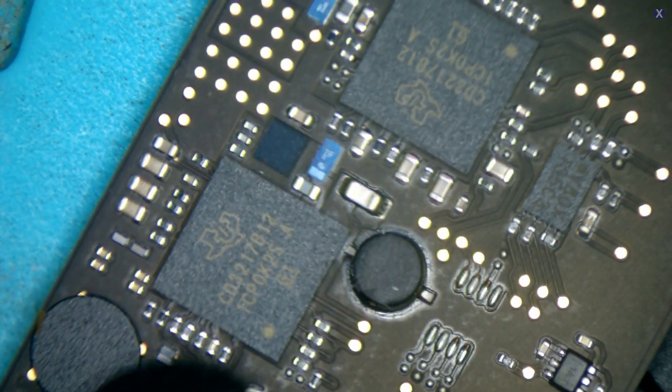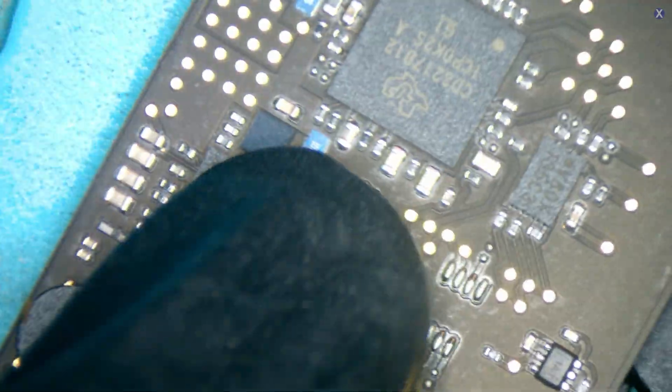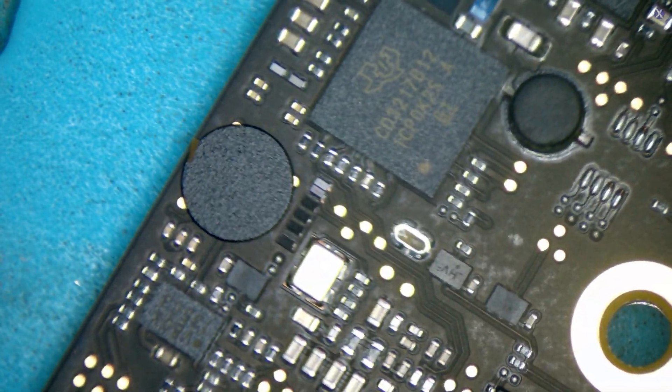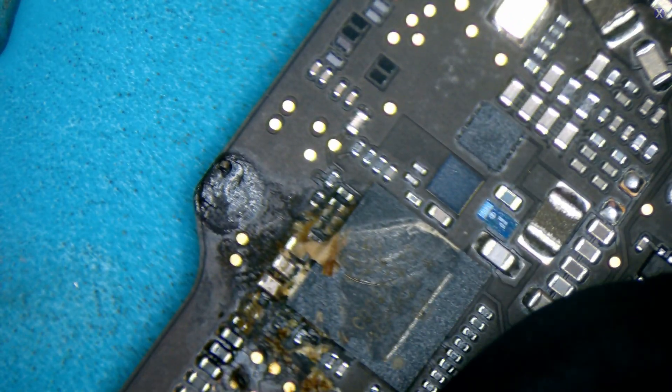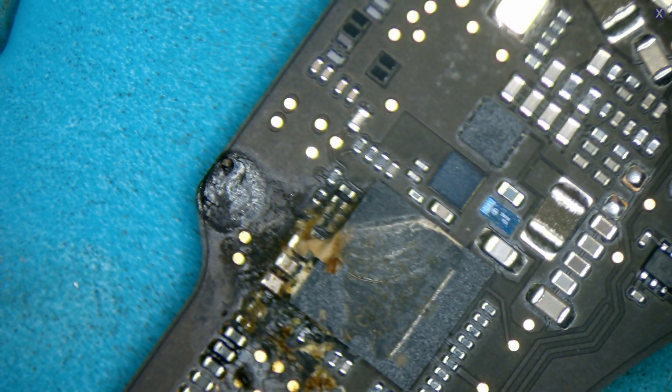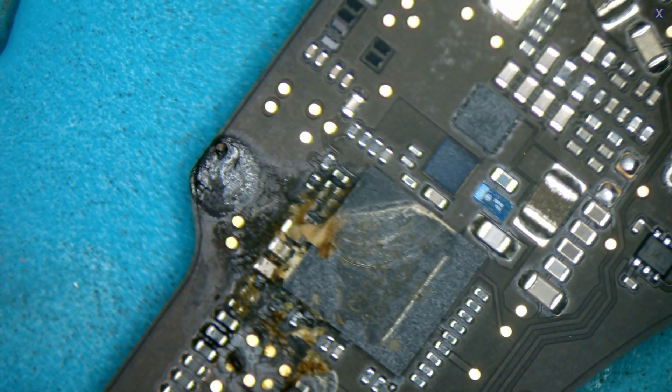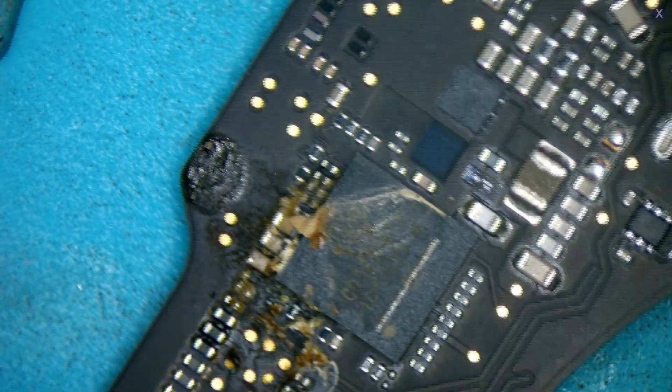You have a bunch of these CD32s and these are your charging circuits. These two look to be fine, but we still don't get a charge on one — we see five volts but we don't see our 20 volts. The reason we see these are fine and still don't get a charge even though we plug it in is because you have to have all of these working. If you have a heavily corroded one, you just won't get a charge at all — it will not charge. So when the battery depletes, it just won't work, period, even though you have two other good working ones.